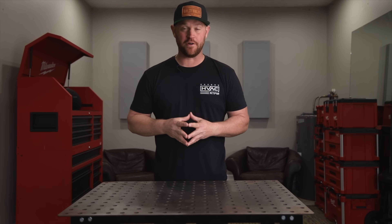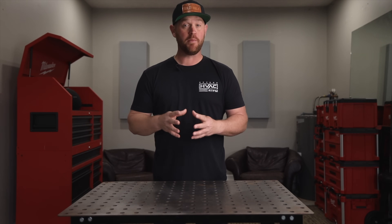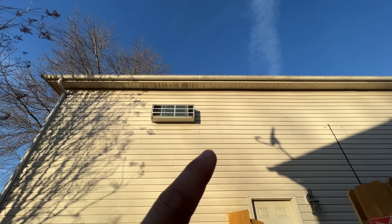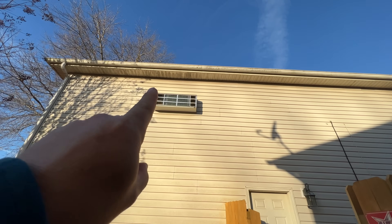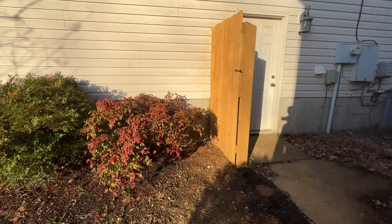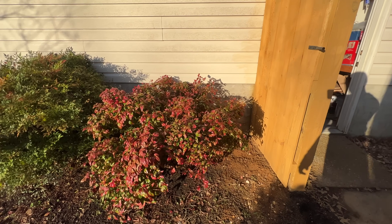How's it going and welcome back to the channel. In today's video I'm going to be installing a ductless mini split in a room above a garage. That's the existing PTAC unit right up there. The head is going to be mounted directly above it so we just run the line set across, come down. We're going to remove that bush right there. There's the electrical panel so we run the piping over — should be good to go.